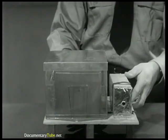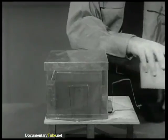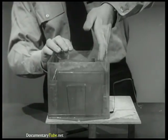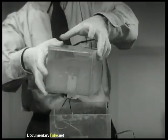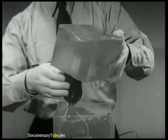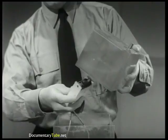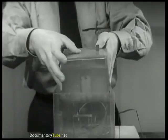Here is the platform on which the battery box and demolition block made their Pacific crossing. The demolition charge is a two and one-half pound block of picric acid, detonated by a fuse. This charge is supposed to destroy the ballasting mechanism. The battery case consists of three celluloid-like boxes; an airspace provides some thermal insulation. A twenty percent solution of calcium chloride in the middle box acts as a thermal overcoat and is sealed by a rubber plug. The solution helps to ward off freezing of the battery at night and excess heating during the day. The battery within a third box puts out two volts and about 10 amps on short circuit. It is a lead-acid wet cell type with five plates; spacers maintain a uniform airspace between the outer boxes.